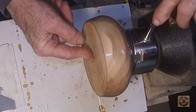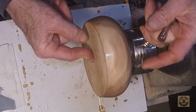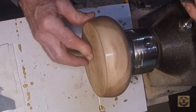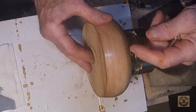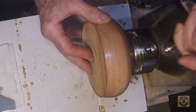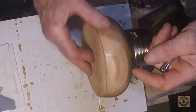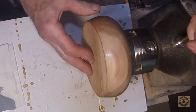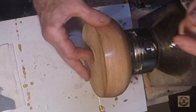During my first year and a half of turning, I put way too much pressure on both mortises and tenons, much more than is necessary. I paid for it a few times in crushed tenons that broke and mortises that split out. Only recently have I learned it doesn't take a lot of force, and tightening each side only once is probably enough.